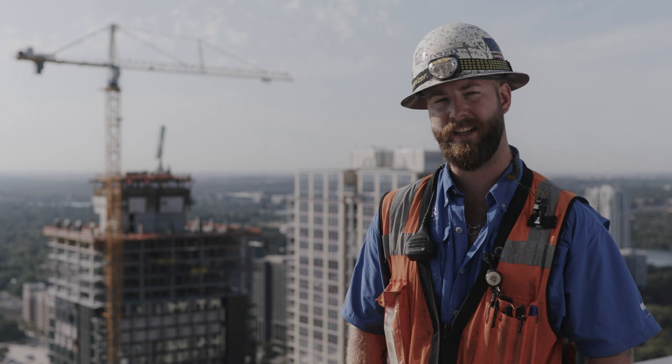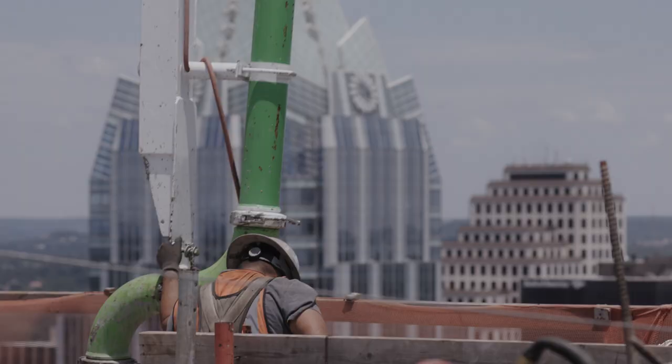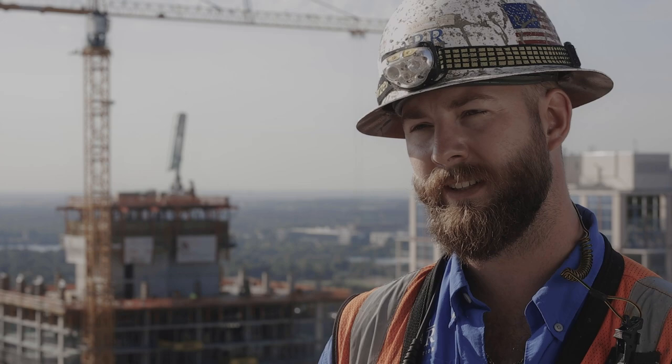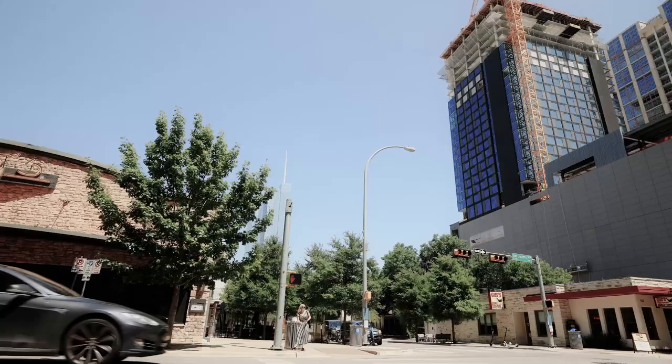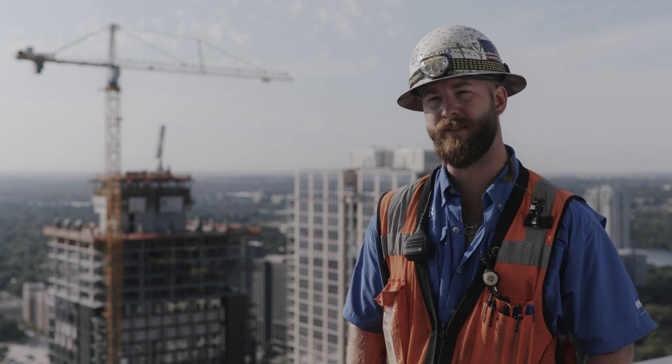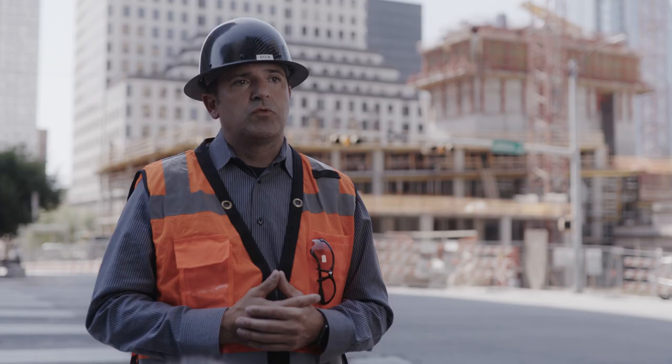Our climbing cycle — we're actually pouring our core wall on the same day that we're pouring our decks. It's another advantage we have. We pour our decks in the morning and in the afternoon we pour our core wall and then all 18 columns in one day. So with the climbing core system, we're able to pour on that day. Next day we're stripping — we'll strip and break all our panels off. That same next day after the pour, we're able to jump it. We've got a couple days of rebar, then we can close walls, and it's a five-day cycle just like our decks.